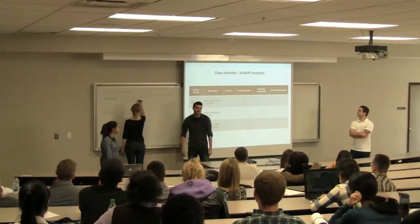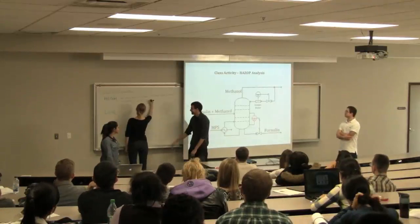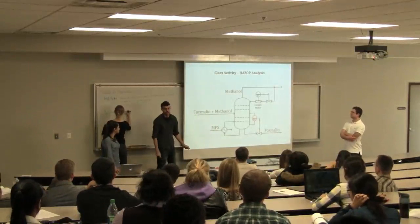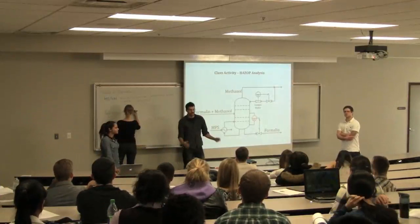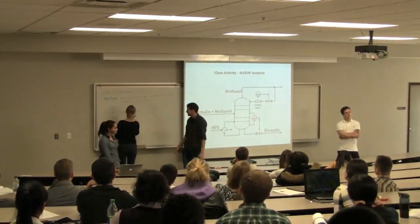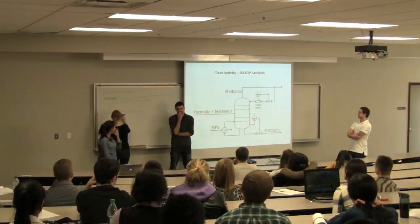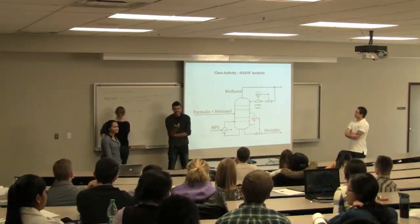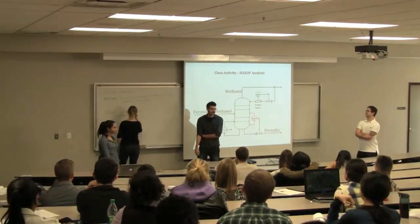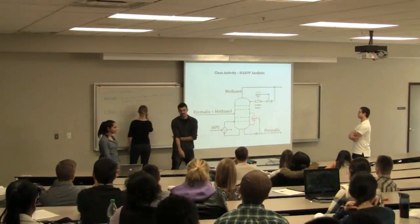Alright, so what could cause low flow? Blockage in the upper valve. Perfect. And what is a consequence of low flow? Low level, thank you. Decreased production, yeah. That's maybe really difficult to manage, what kind of problem is this? Okay, decreased production, anything else? Perfect. Anything else? It could be damage to the separator, right? Because you don't have the right levels.